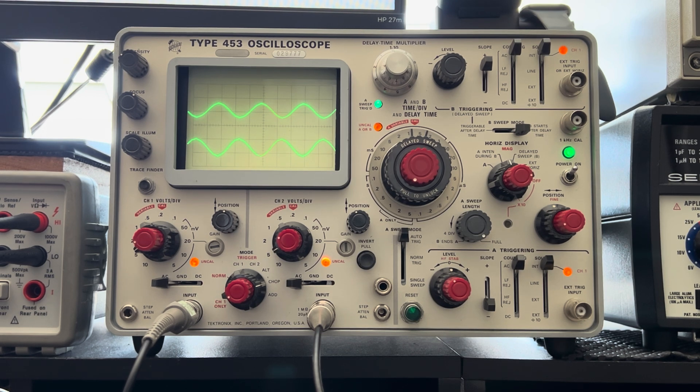Speaking of recovery, looking at the '61 Fender Bassman 6G6 Revision A. There were lots of revisions, and a lot of circuit changes that weren't exactly covered on the various schematics that are out there. The issue with this one, if you recall from the prior episodes, would be a hole in the sound after really driving the phase inverter or the output tubes — you strike a chord while the volume's up.